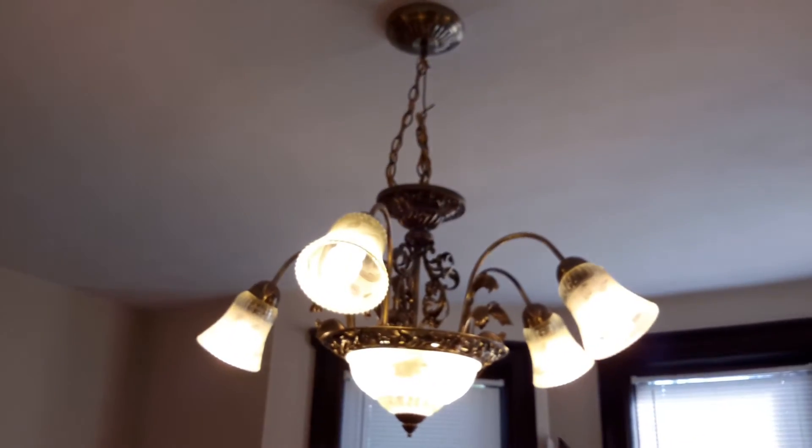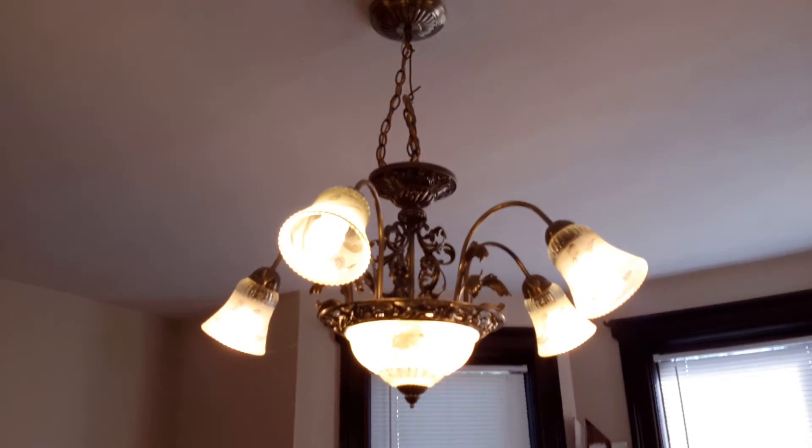So we have a white wire going from there, through the ceiling, down to the switch. And hopefully the white wire goes from the switch back up to the light. Probably the white wire is connected somewhere else further along. If that's the case, what you'll need to do is run a new hot wire to the light and a new switch. So be careful about that — the white wire switching. You see that a lot in bathrooms.